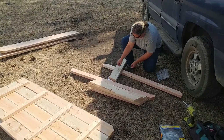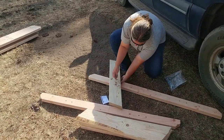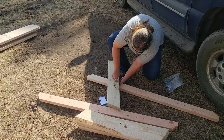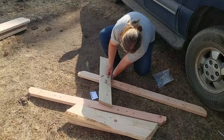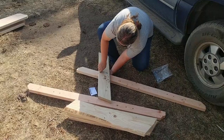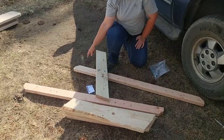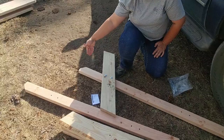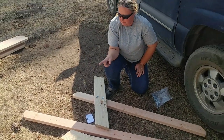The bolts just go through your support — there's a washer and then the nut. On the package it shows that the support is just a regular 2x4, but these we got from Home Depot are actually notched. So when you're doing this, you need to plan on the little angled piece being underneath the bench, which will only be a big deal when we get over there.